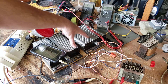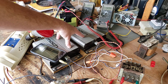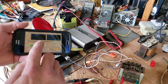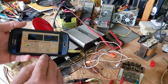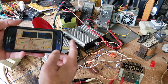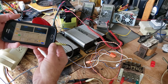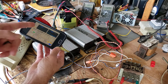They put out about 20 volts apiece. What I did to make it a split phase is I used a function generator — I have one on the left and one on the right — and I put my phases for left channel and right channel 180 degrees out of phase from each other at 60 Hertz. So this is going to be a pure sine wave split phase inverter.